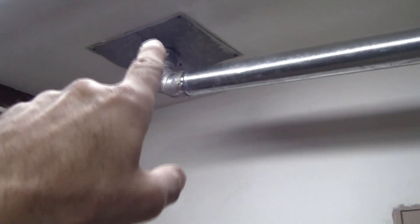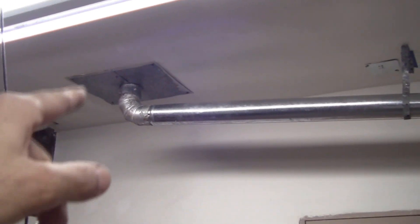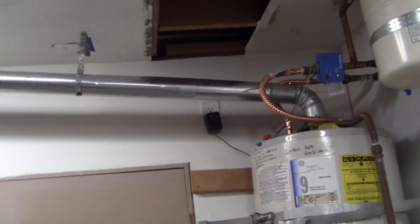I do still have a couple of concerns. Number one, that's single pipe vent and they don't have the six-inch clearance, so technically I'm still breaking the code on that clearance. I'm not replacing the water heater or doing a roof job at this time — if I were doing a roof job I would change it all out to B vent. But all things considered, this is a happy medium to have a sound venting system and be as reasonably close to code as I can get without going crazy.